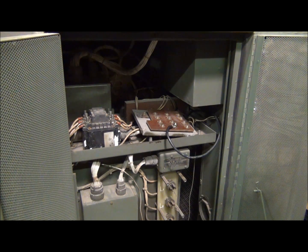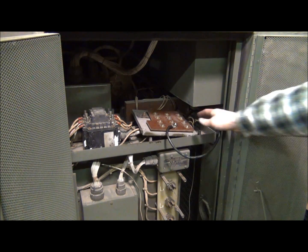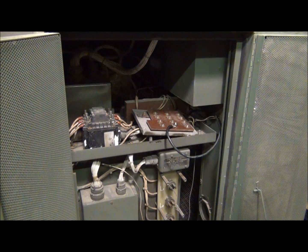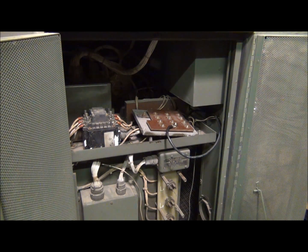Our X8HH16B that we removed from T8 is still floating loose under there, and we're going to be connecting that to T11. But we're also going to be moving another lead to T11, so before we connect that up, we're going to remove that other lead. The last lead we need to remove is X12EG16N, and we're going to be removing that from T12 right here. We've got our two loose leads floating under there, and we'll go ahead and hook them both up to T11. T11 is pretty hard to get to — you're going to have to muscle the board around and make some slack in the wire, but you'll be able to get your wrench in there.